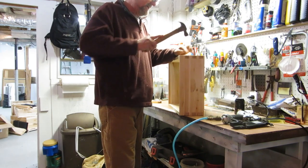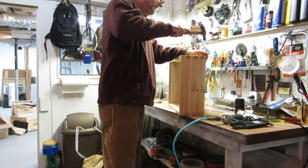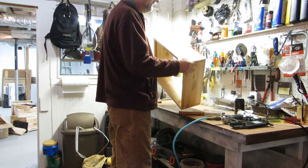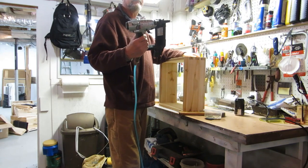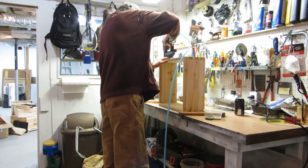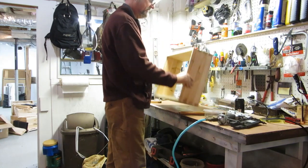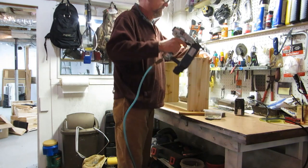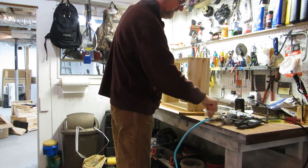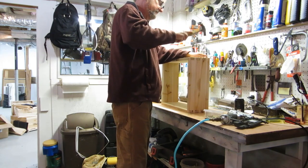Back with the nails — they were pretty big nails but they didn't split the wood yesterday. Put them in all the little areas marked for them; try to get them as centered as you can. It doesn't crack the wood. By the time I did this yesterday it was pretty stable. If you happen to have a nail gun, use it — it's quick. I didn't put any glue; I don't think it's necessary. I'm going to polyurethane them, so they'll be waterproof either way.